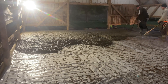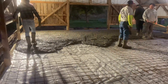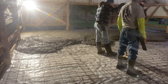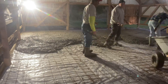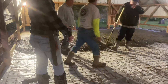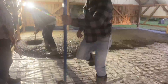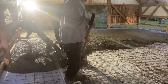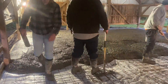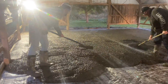I'm pulling the wire up. I got three wheelbarrows going — two of those big Brentwoods, which I highly recommend for moving concrete. I'm sure somebody's gonna ask why we didn't use a pump. We don't use pumps very often to do these floors. We can wheel them pretty fast, and it costs about $1,000 to pump a floor like this. When we pour concrete with a pump, we also have to pour it a little wetter, and we don't like pouring wet concrete. You can tell it's in the fall — everybody's got hoodies on. We want to keep the concrete pretty stiff. This is a pretty thick slump — probably about a four and a half to a five slump. You can see how it just kind of sits there when they dump it, and when you kick it around, it doesn't really move.